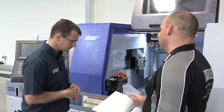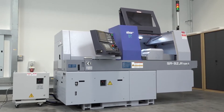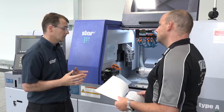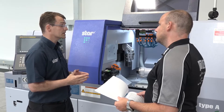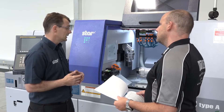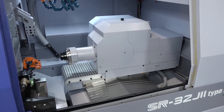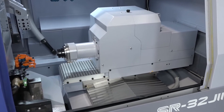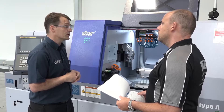Tell us a little bit about accuracy on this new machine. The J2 model has a different base, with a lot more casting built into it. The webbing has increased from 20 to 25mm. Inside the cutting room as well, there are a lot more internal covers protecting the base from hot oil, so thermally it's a much more stable machine tool.